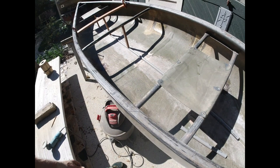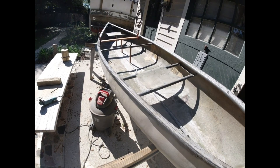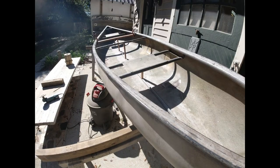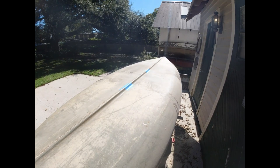First step will be to epoxy it in. I have a little bit of glass — I can put some glass patches on it — but I don't have a roll of glass tape, which is what I want to use. I'll get started: take this out, clean it really well, clean the glass really well, and wipe down the PVC pipe. The pipe is giving it its shape, and the shape makes it strong. First step's going real quick — no big issues, just lots of sanding and grinding.